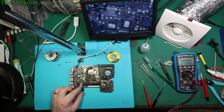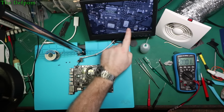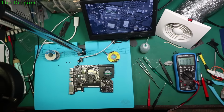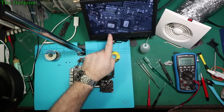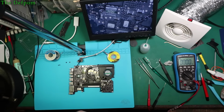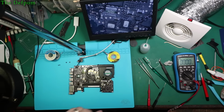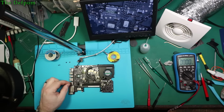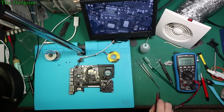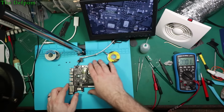Anyway, what they've got is two MOSFETs right here. Right? One's positive, one's negative MOSFET. The fact it's going full means the negative wouldn't be pulling it down. So I replaced that negative MOSFET. Right? Replaced that one again. I think I replaced it before, swapped out another one, and I swapped this one back in again now. So the one that's in here now is actually the original one that was in it. It's one of the things I swapped when I was trying various things. Anyway, so I've done that.